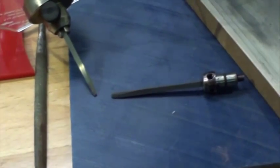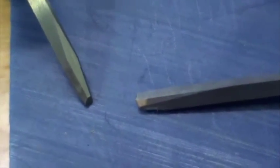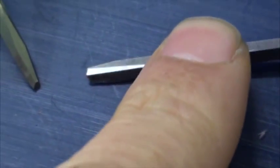Last night I cut this and I thought, okay, I'm only going to do the last step. To grind it down with a 260, then a 600, took about half an hour to prep the graver, all the angles. Now remember, this started out as a 90-degree graver, and I've ground the back of it. Here's my original one. I've ground the back of it so that it's 120 degrees.